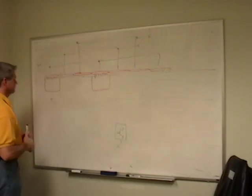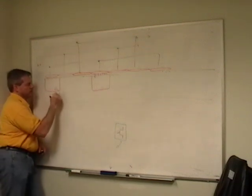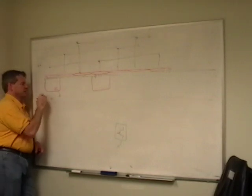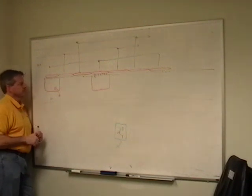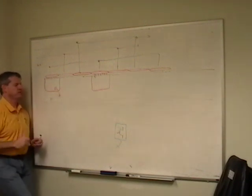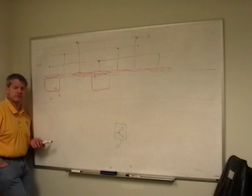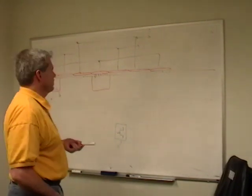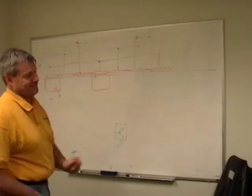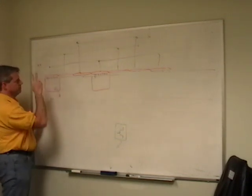So I've made this positive. I've driven all the holes out, all the little holes want to come running this way. And so there's no holes in here. Only electrons. Except we started off with a P plus in the first place. And because it was a P plus, there were already more holes than electrons to begin with, right? So there's nothing in there. Not even, there is, but you know, there's a few. You get occasional heat that causes an electron to bubble up.